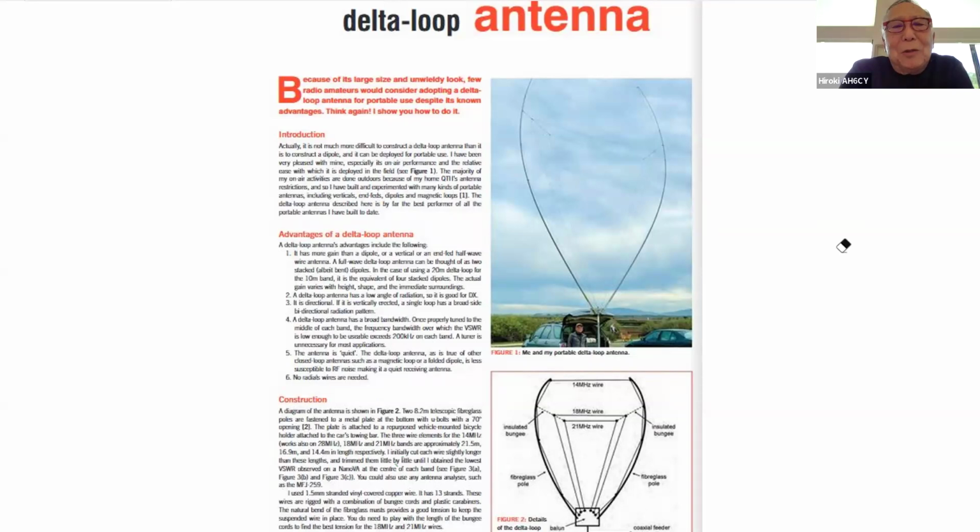So what you need to use is the fiberglass telescopic pole. Fiberglass telescopic poles are available probably in US dollars anywhere from $100 to $200 a piece for 30 feet or 10 meter height. Somebody told me that if you go to some of the Chinese vendors, you may be able to acquire them even less expensively. But be that as it may, the telescopic fiberglass poles are bendable, as you see in the photos, and this bend offers a very nice spring motion.